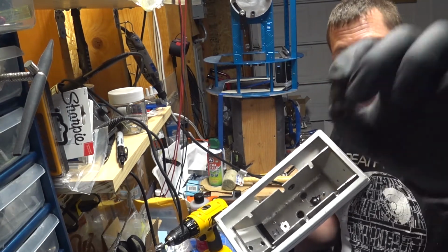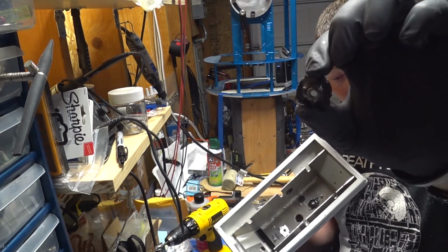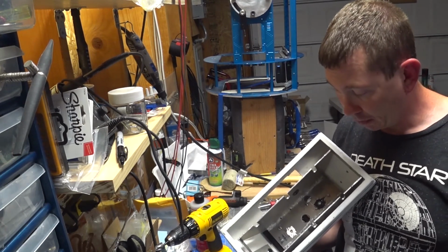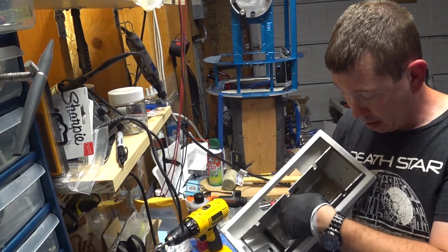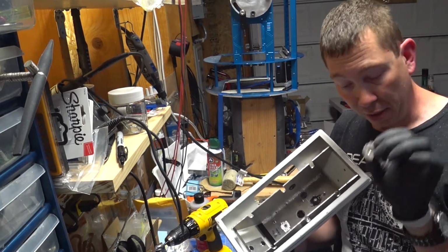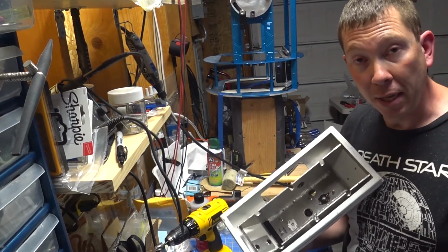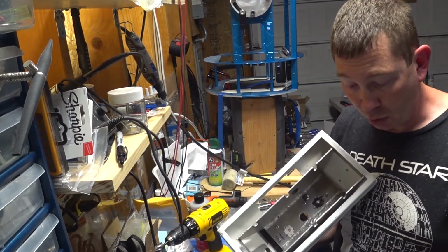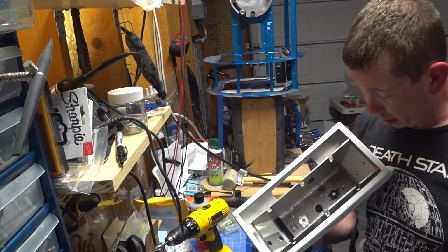Alright, so here's one of those nylon lock nuts, and you can see that giant mass of JB Weld around it. Now what happened was, this snapped off fairly early during this process while we were working on this tonight, and I need to reattach it. So I've roughed up this portion. I've also roughed up this, so before the next episode, this will be reattached back in its position. The nylon lock nut will be affixed with JB Weld steel. That should hold it in place.